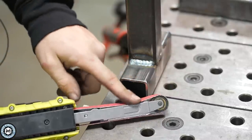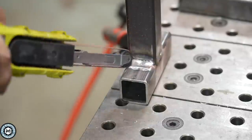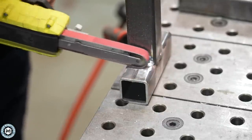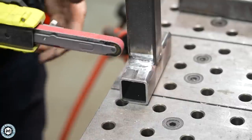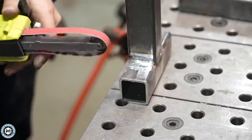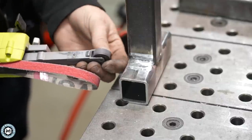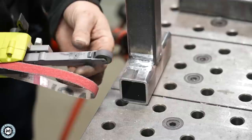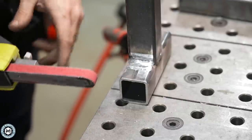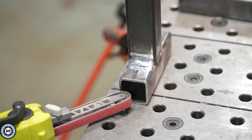This is the most expensive tool I showed, so I'm going to do the other side with a cheaper half by 18, so you can see the difference. Definitely a lot harder to do because this wheel and belt is so much wider. Something you could do is crown this rubber wheel if this was specifically what you were going to use it for. I don't know if Ryobi sells additional tooling arms — I've never seen any. But you are able to clean it up, just not as easily. If I wanted to clean up the inside edge, it's super easy to do that.